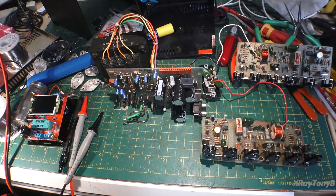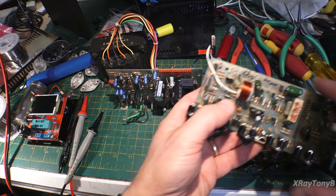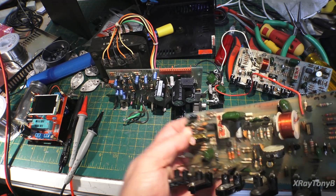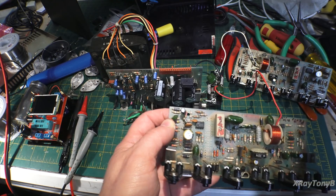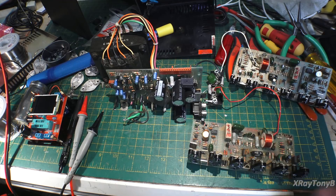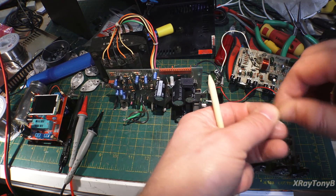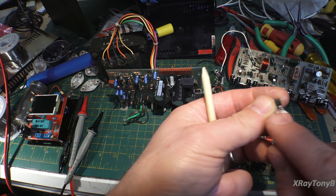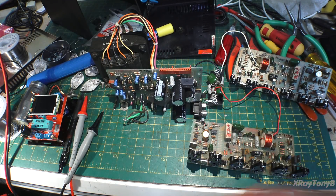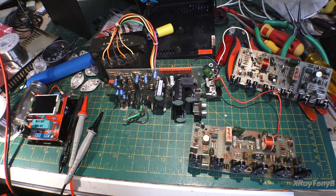My replacement transistors — this one here and this one here — they're actually reversed. The emitter and collector is backwards, which means I had to flip the transistors the opposite direction. The old ones went EBC and the new ones were BCE or something like that. But that was not a problem at all — other than that, they spec'd out identically, so it'll be a good replacement.